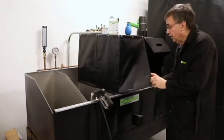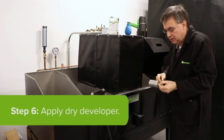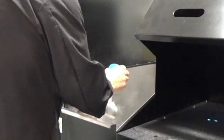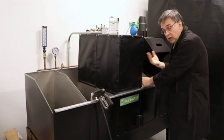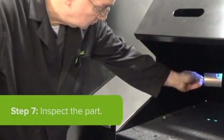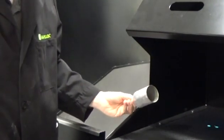After the part has been dried, we're now ready to develop the part. We use a developer to wick out the fluorescent penetrant that may be in indications. In this case, I'm using ZP4B dry developer powder. We coat the part in developer powder and again we have a dwell time involved. Once that dwell time is done, we will inspect the part underneath the black light and look for indications. Then you will clean the part once you're done and proceed as your process specification dictates.